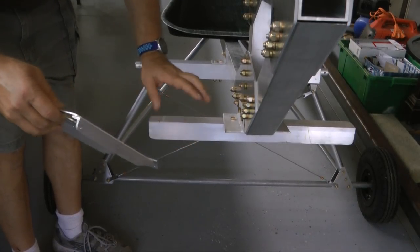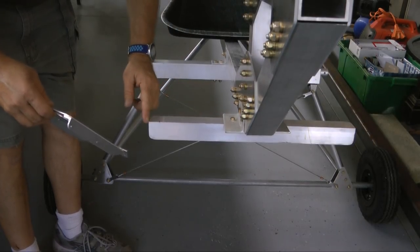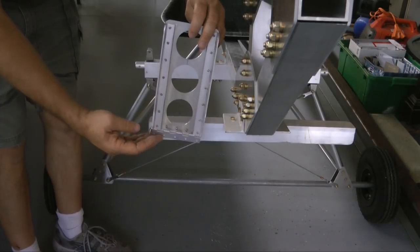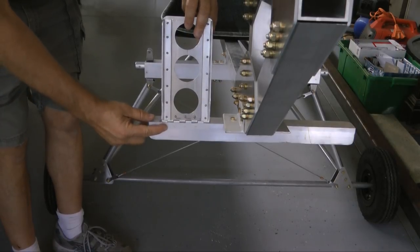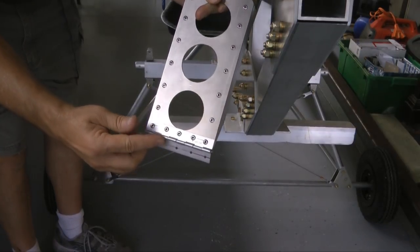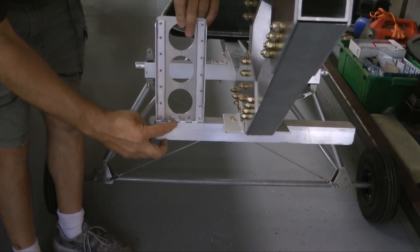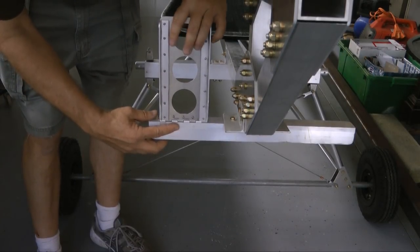Now, for mounting this on our rudder cross piece, 1 inch in from the edge, and the rudder, of course, facing towards us. The hinge will sit up here, and you can feel it stop when the barrel, which is up front on this, touches the edge here. So it's very easy to place, and we'll have it 1 inch from the edge.